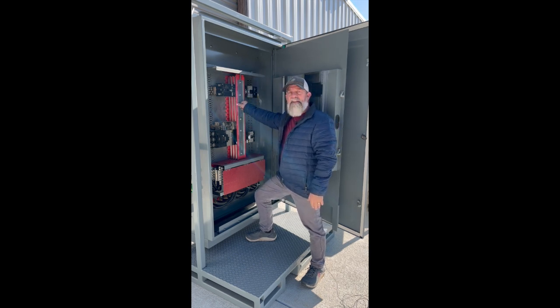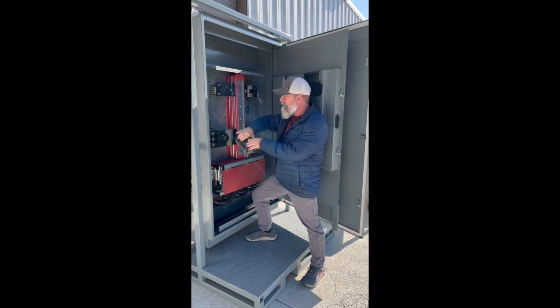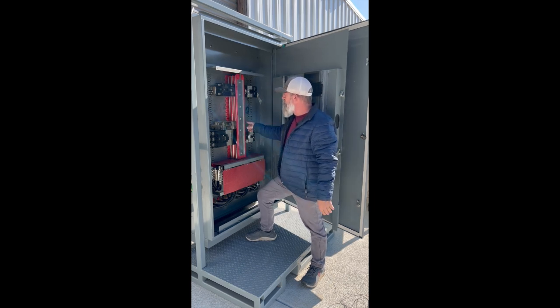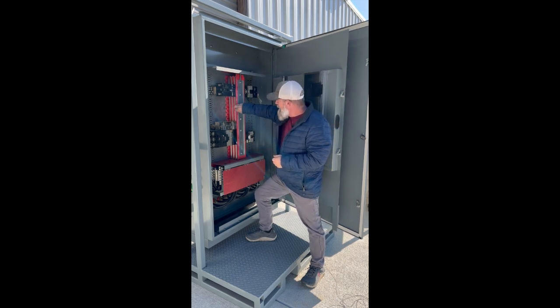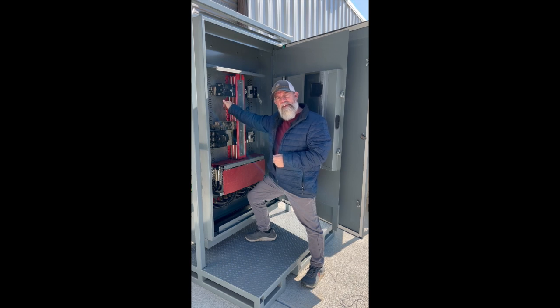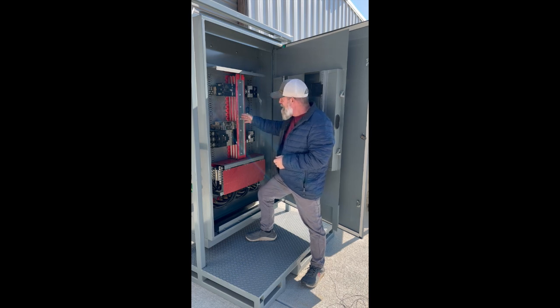One of the obvious components is the red insulator board here — that separates the copper bus. The conductors are in between; you see that little silver bar right there, that's your conductor, and it actually fits into your I-Line jaws right here. After you get the conductors, what we like to do is take denatured alcohol — you don't want to use an oily-base solvent because you don't want to leave a residue that could flash over. We'll take clean rags and alcohol in a bucket, back the breakers out, start cleaning the insulators, then go to the conductors. Wipe them down, run your finger across to check for rough spots, degrease, and then hit it with a little Scotch-Brite to shine it up.